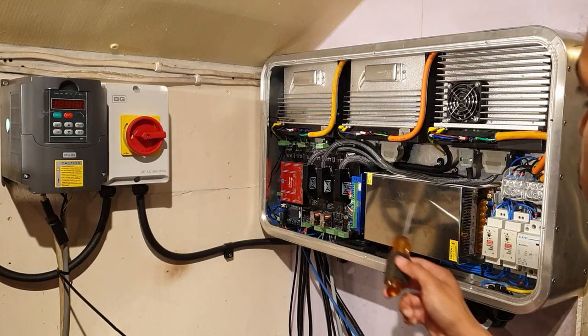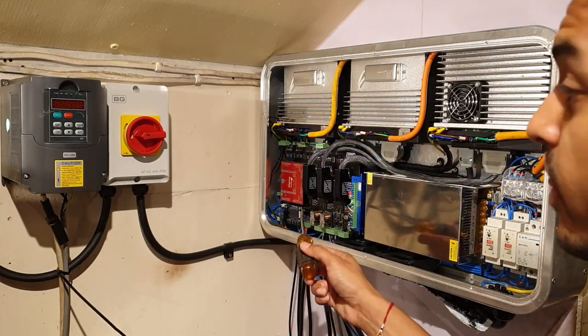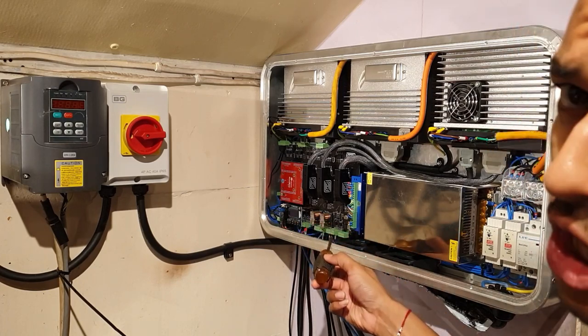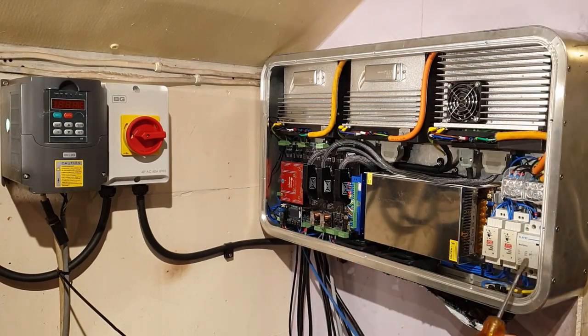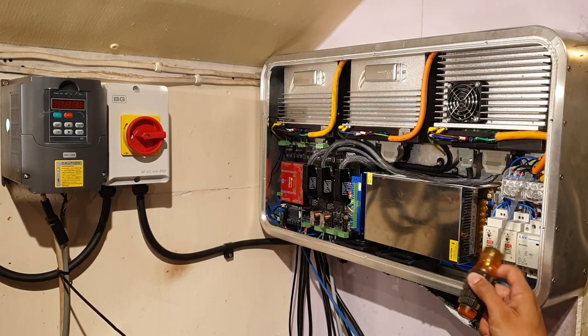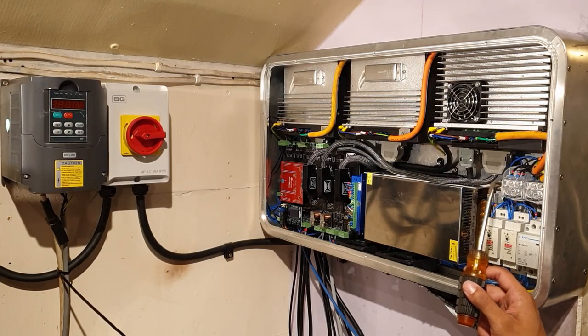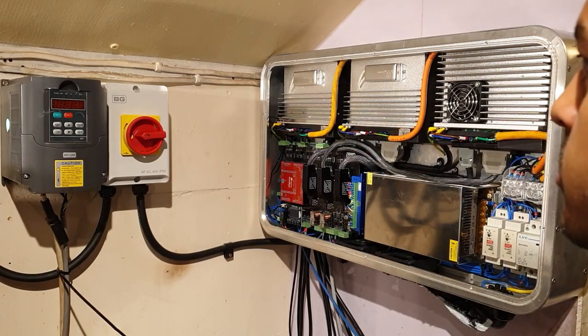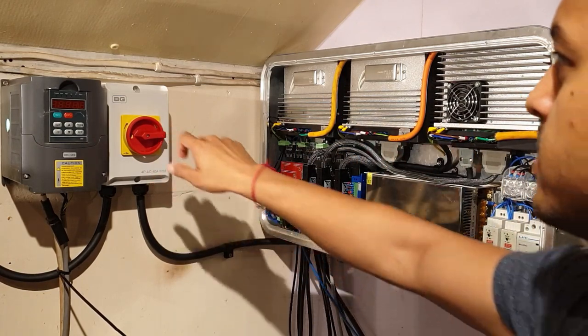But the actual power to the drives, they only go on when the actual software, Mach 3, starts up, and then that activates that relay through the charge pump signal, which in turn activates that relay, which supplies the live, or switches the live, to these, effectively, they're like contact terminal blocks, or terminal blocks over here. And then that supplies the power to all the drivers. So I'll go ahead and I'll turn that on and I'll show you.